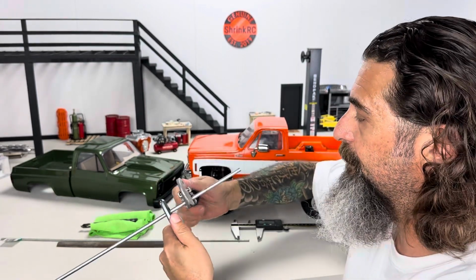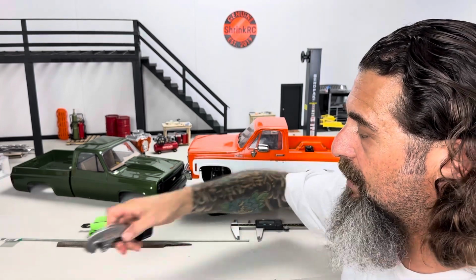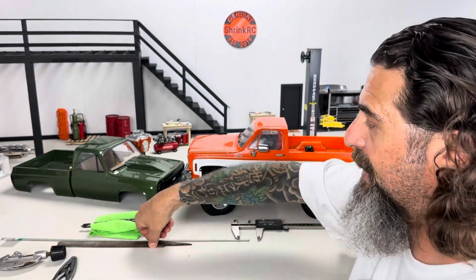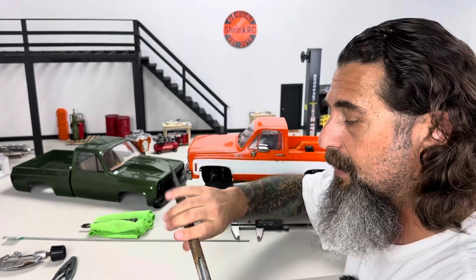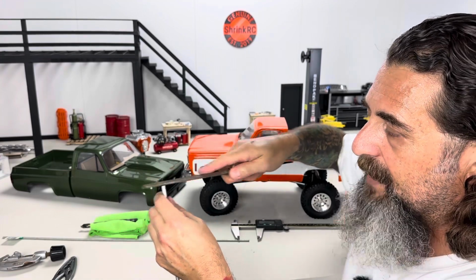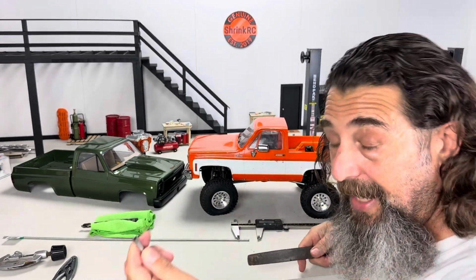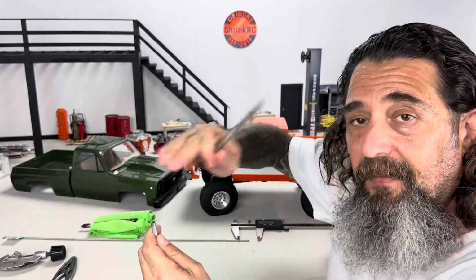off your tubing. So now, after you've got your 4 lengths of tubing, and you might start off by cutting them just a little bit longer than 66 millimeters, like I did, and then what you can do is go back in with a file. Always use a file with a handle on it, and you can take that end and just get it nice and flat. You're going to have a little bit of a burr on there from using the pipe cutter on it. You can cut this with a hacksaw instead if you want, but with a hacksaw you're probably going to start off with a cut that's not perfectly straight.